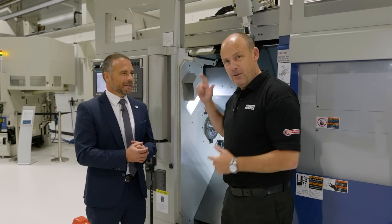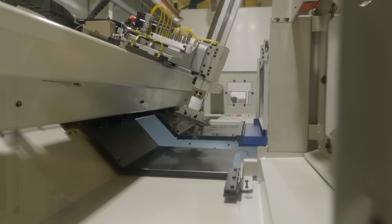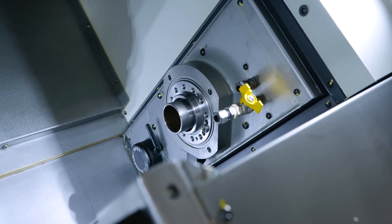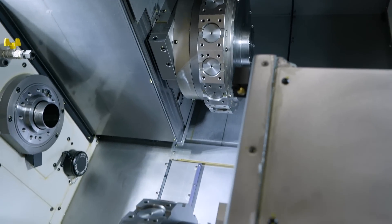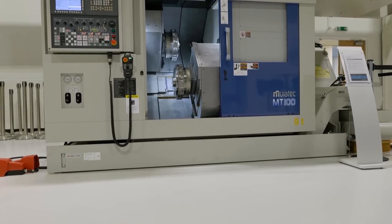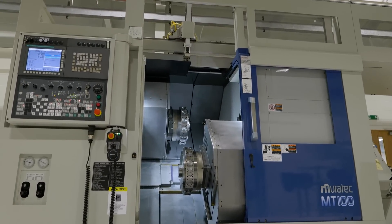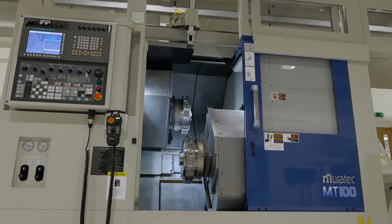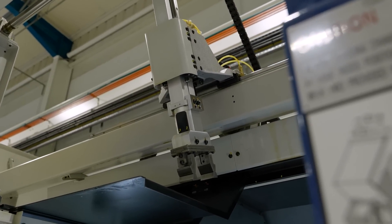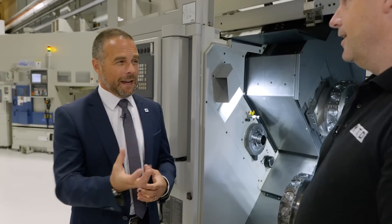How quick are these as well? It actually flies. Our unload time — we can get down as far as four seconds on some of the MW machines for billet loading. But on this type of machine, if we're looking to unload a component, we can unload shafts. The maximum length of component that you can unload through the parts catcher — it's actually a gantry robot unloader — is 790mm long. There aren't many lathes out there that can unload a shaft at 790mm long in under five seconds.